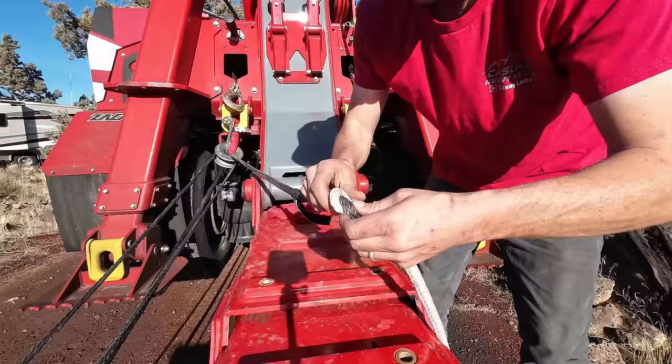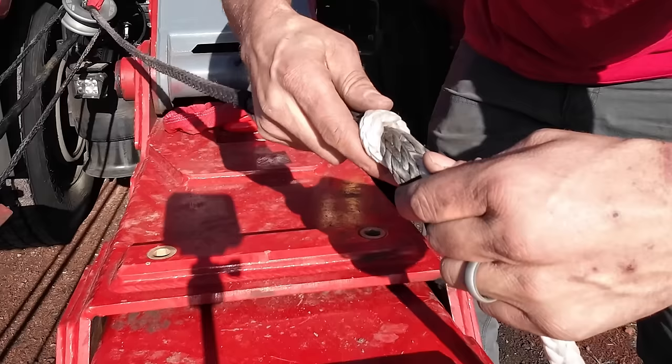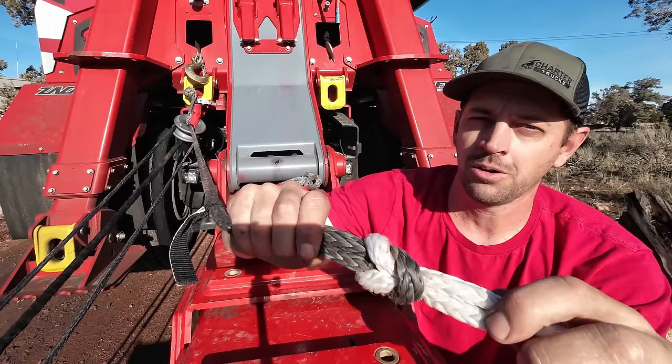So what you need to do is free it up, make sure everything's nice and free, the twist is out of it, and set it again. Now we're parallel legs in — no twist. Parallel legs in — no twist. Now we have a strong knot. Now this is ready to pull on, but there is still a reduction in working load limit. There are people out there who claim to be experts and claim this maintains 100% of the working load limit, and they are wrong. That's just plain and simple.